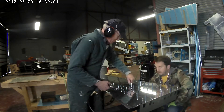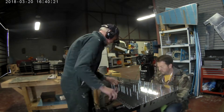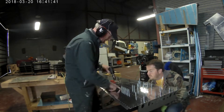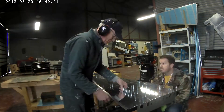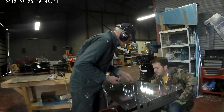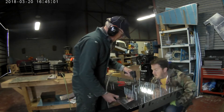And because it's kind of suspended in air like that and it's just that skin — for instance, I have the mushroom set on my rivet gun, and you need to keep that head flat. Cannot stress this enough, because if you just have it over enough for the edge of your mushroom set to hit that skin anywhere, it will bend.